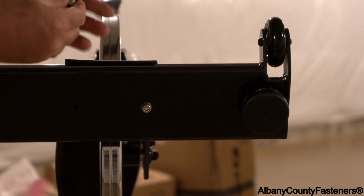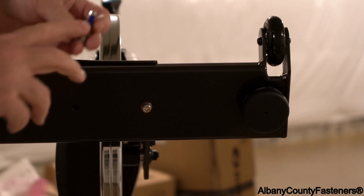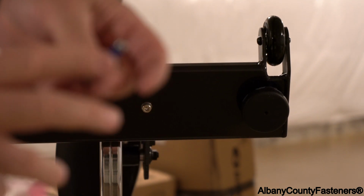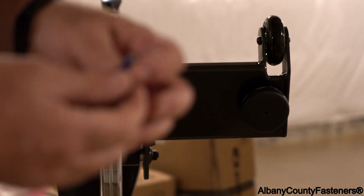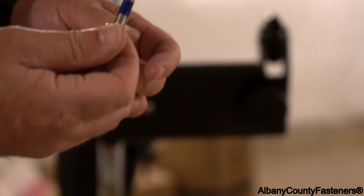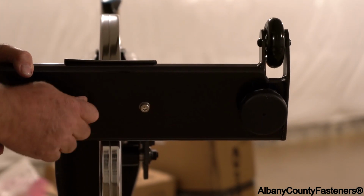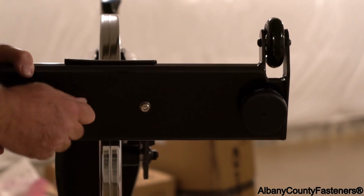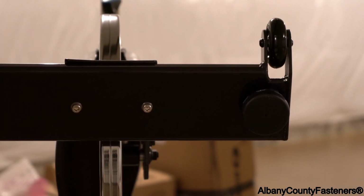Okay, that's one. And you'll see these screws, they have what they call patches on them. This little blue, the black, blue, red, all kinds of different colors. That's to prevent the bolt from vibrating loose. So once it's put in, it stays. And it makes it a little tough to tighten it, specifically by hand. But you'll feel it, it snugs up.